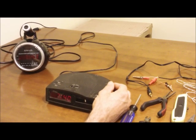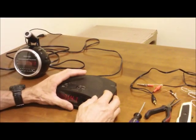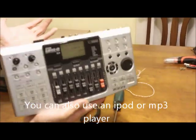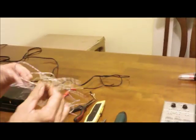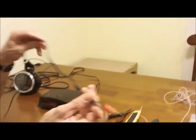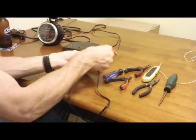So that tells me that this radio is transmitting to that one. It'll work the other way around too. For this project, what you're going to need is just a handful of tools. You're going to need an input source — I don't have a tape deck, so what this is is an 8-track recorder and player. You're going to need some extra wire, any kind of bell phone wire — this is like 18 gauge. I also took the liberty of snipping some RCA cord and putting alligator clips on the end so that it's easy to connect.